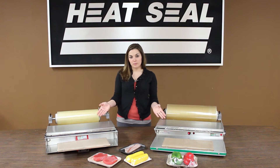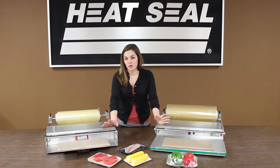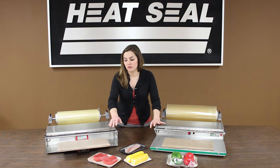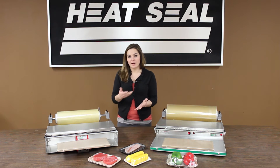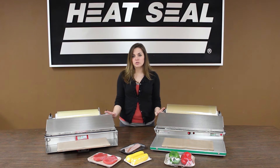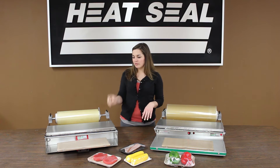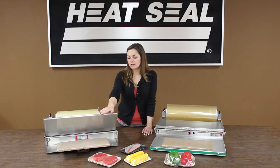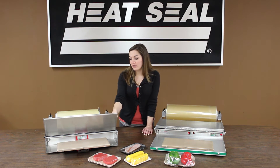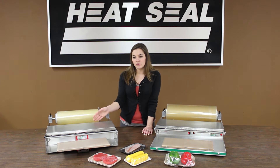As long as the power switch is on, the cutoff rod is going to be maintaining about 275 degrees — so it's still going to be on continuously — but the seal plate will remain on demand. The next similarity is the wrapping bridges, which are both stainless steel to be very easy to clean. On the Energy Smart wrapping bridge, we've rolled the front and the back of the wrapping bridge to make a smooth film path so the film doesn't get caught up on any rough edges.